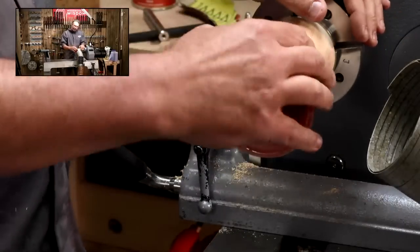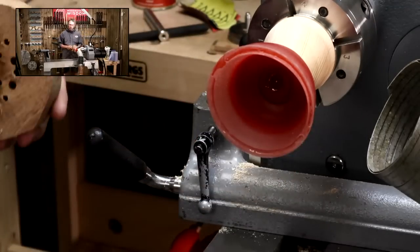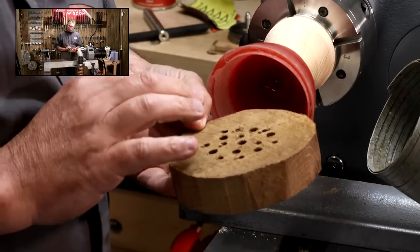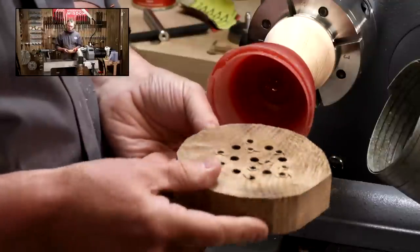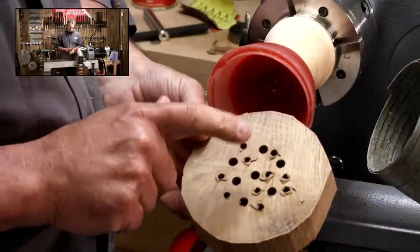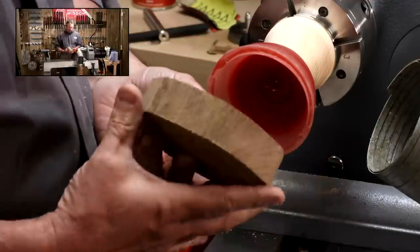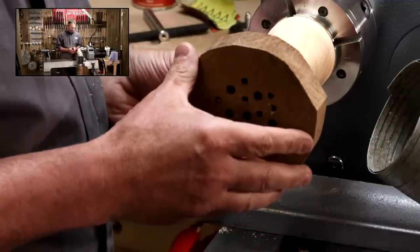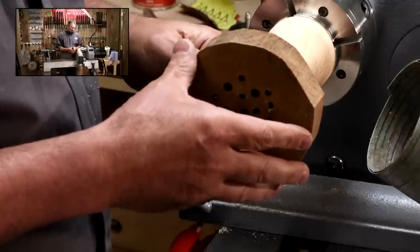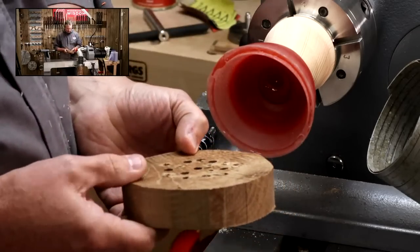What I'm going to do first is just clean the outside up and tidy up this top edge. This piece of timber is going to be the top — I pre-drilled it to keep those holes nice and clean. There's a lot of work to do on that one. That middle hole is what we're going to use on the screw chuck. We're going to clean that up afterwards, then go into making the lid. The lid is going to sit over nicely, and the recess it sits into is actually my hold point for expansion.